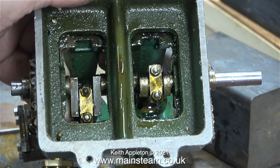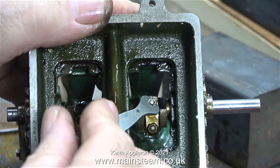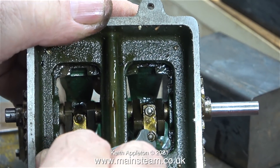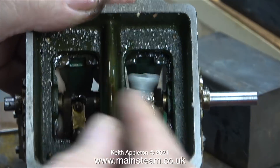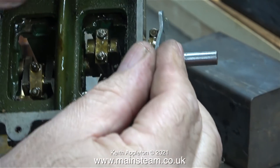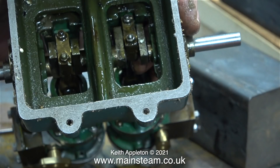I mentioned earlier that there's a tight spot when I turn the crankshaft — I think someone has over-tightened the bolts on the big ends. This is very common, and yes they are extremely tight, almost close to shearing off. It's most important that small parts like this, especially when they're holding soft pieces of metal together like gunmetal, are not over-tightened, because the entire gunmetal block distorts and then you get a tight spot.